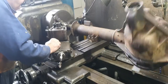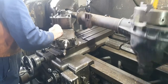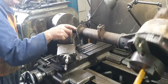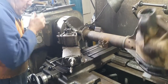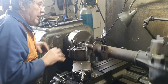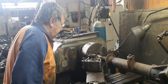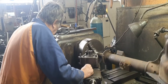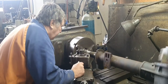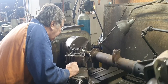Yeah, so I've got those lock nuts on there with a lock washer and a keyway. These housings have very agricultural methods of holding the dual wheels on. They've got this little channel wedge driving into a nylon lock nut. They've been known to come loose. We made them up. I'll show the viewers then, because we've got these housings and I want those lock nuts. I wonder if they don't kill someone when these wheels come off.